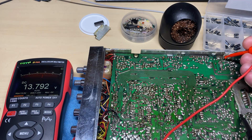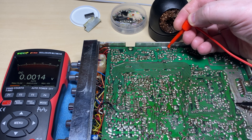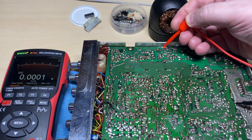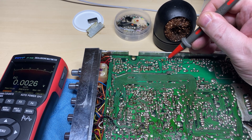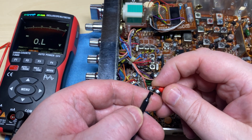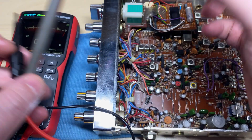I monitored the LSB control line and there was 13 volts on it. That's definitely not right because that line should have 8 volts on it. We've got 13 volts coming out of the regulator, so everything is being over-volted. I tried again with a better probe - 13 and 13. So the zener diode in that circuit is open circuit - I think it's a 7.5-volt zener. That would definitely stop it regulating.